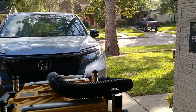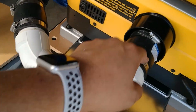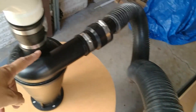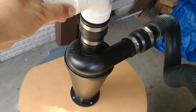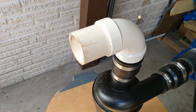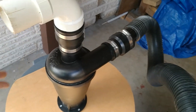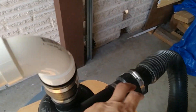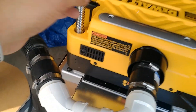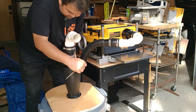So let's hook it up. I attached the exhaust side to the little PVC pipe assembly I made earlier, and I just attach the hose coming into the cyclone inlet. Normally the output would go to the vacuum cleaner since the planer fan is blowing, but I won't use that for now. If I need to use it as a dust collector for other equipment, I'll put that side to the shop vac. I can easily flip this thing around and move it to whichever side I need. The good thing is you can always spin the assembly to access the screws.